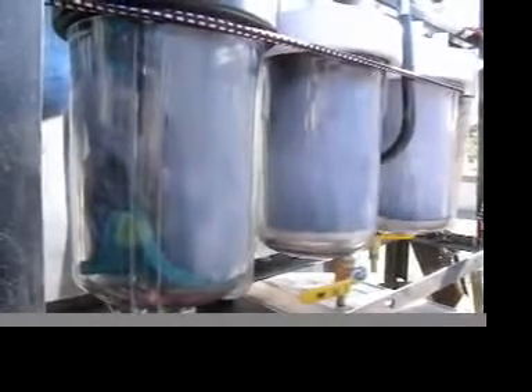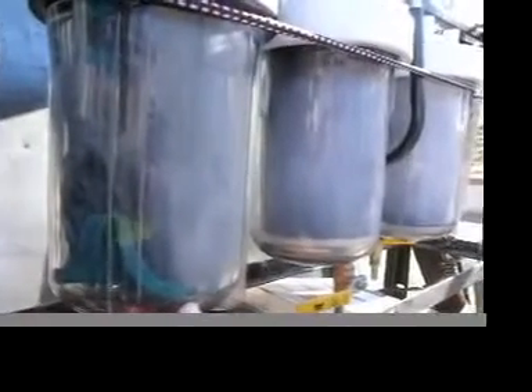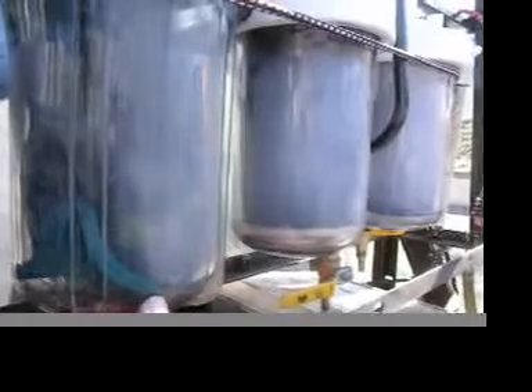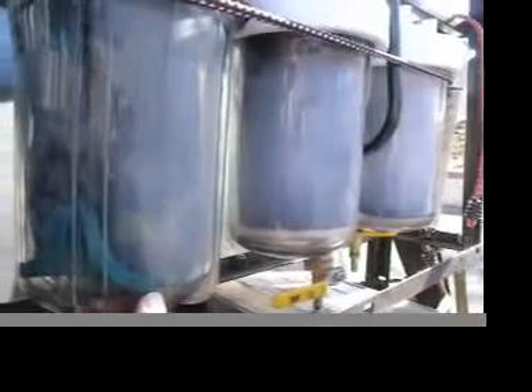This has caused me to reconsider my approach. The blue seal on the bottom of this canister indicates it's a Type R canister, designed for a wide range of solvents — which I thought would be fine, except the solvent it doesn't handle is alcohol. So I've had to conclude that I cannot use cartridge filters anymore and will have to use bag filters. I'm in the process of trying to modify my cartridge canisters to hold a bag filter.